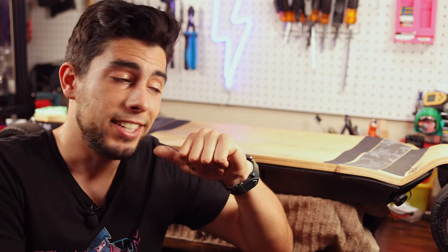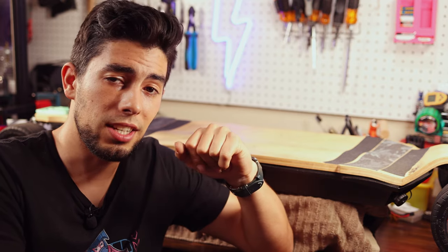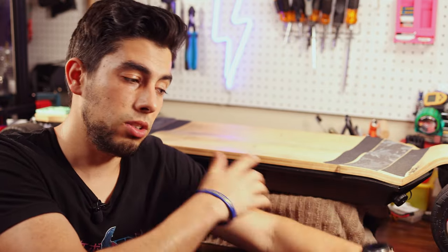It looks really nice, and hopefully you guys enjoyed this super long video. I'm sure this video is probably one of the longest battery building videos I've done, but it's an 18S battery, and a 6P is nothing to sneeze at either. To be honest, 18S takes way longer than 12S just because there's so many more balance leads to connect. There's so much more welding to do, and yeah, it's a lot of work.